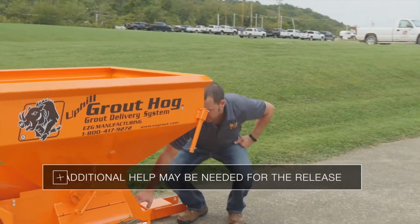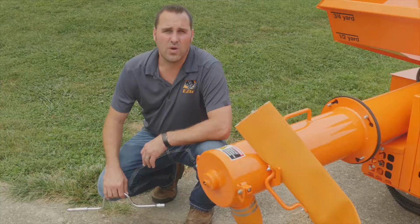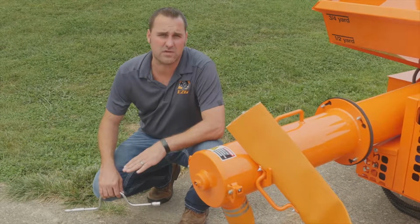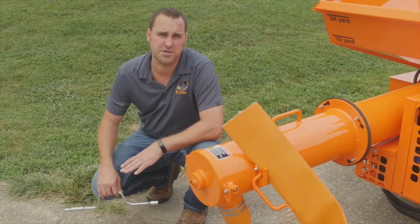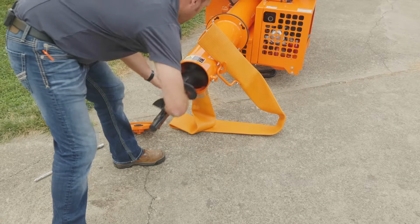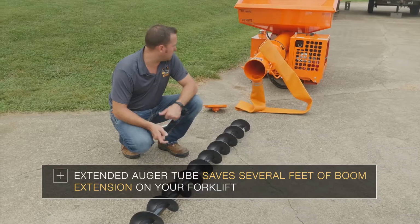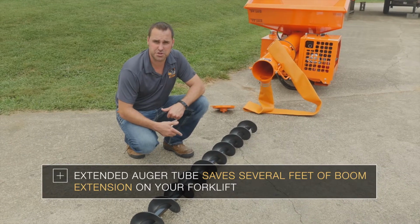You've got a rod across here, you've got to pull the rod, push the hopper up. Once the hopper is leaning towards a downward action with the auger tube, it's time to remove the end cap. Once the auger is removed, then you can hose down your auger and your hopper. Finally, the auger goes back into the hopper to finish your cleanup process.